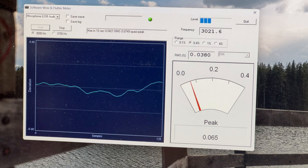Speaking of which, the UKZ parts in this deck are right yonder. You can see they're kind of shoehorned in there, very little room for these parts. UKZ parts are enormous, and I just barely got them in there, but these are the four caps directly in the recording chain, directly before the recording head, and as of right now, the deck is still auto-calibrating with these parts, so I think we're going to get away with this, but